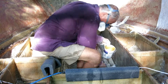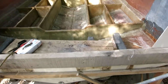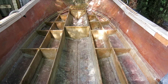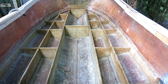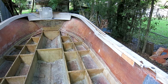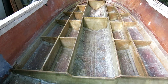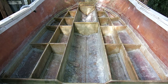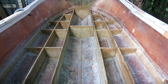I got a lot laid and I'm seeing light at the end of the tunnel as far as these stringers go. Ladies and gentlemen, the stringers are — well, not complete, but almost. They're complete enough that I can start working on the fuel tank and the transom. All they lack is I want to double up the cap — the glass I wrapped across the top — and I ran out. So it all has at least one layer, but some doesn't have two layers yet. Pretty stoked — time to start messing with this fuel tank. Well, it's not ready to go in yet, but I'm ready to figure out how to put it in.